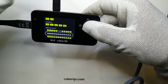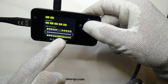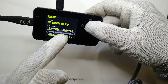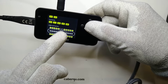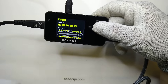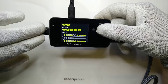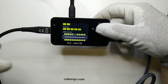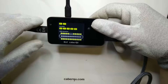If we take a look at the regular cable with the connectors on top connected to the extension cord, we can see if we can reproduce this error and check if all pins are connected. This way around it actually works — we do have the USB 2.0 connections made and they pass straight through. But for backwards compatibility, those two pins are not connected through, so you can have an adapter from USB-C to USB-A or micro-USB where connecting in either orientation only results in a connection being made on one of the two D+ or D- USB 2.0 lines.